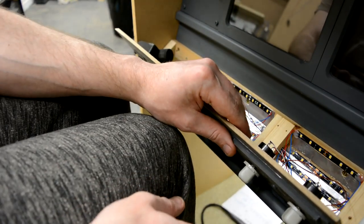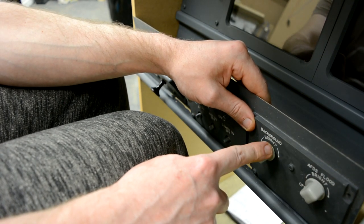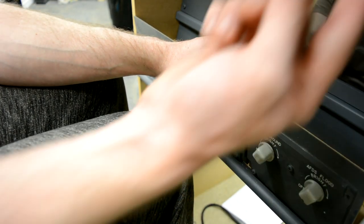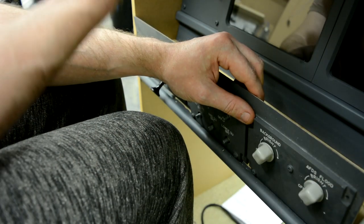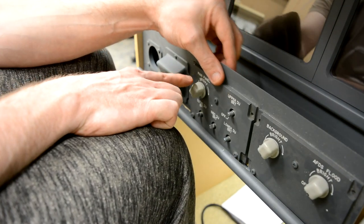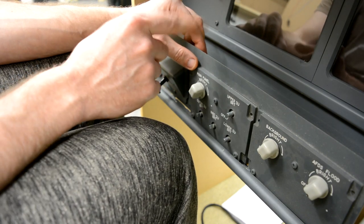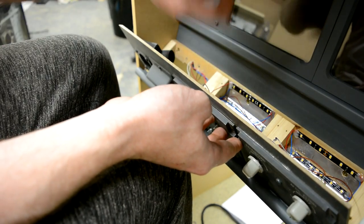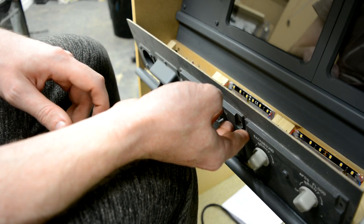So we've got AFDS flood, which we've just done, background lighting, which is the lights underneath the MCP shelf, and also underneath the two glare wings. And then over here we've got the main panel, which is all the backlighting, such as this lighting in here. And that's the backlighting for the MCP, the EFIS, and the main panel itself.